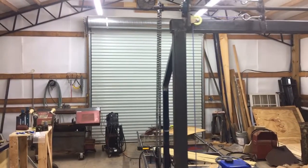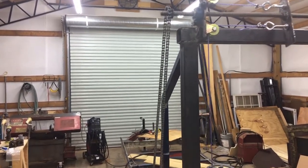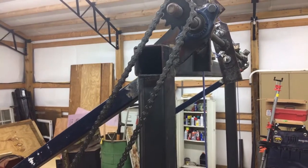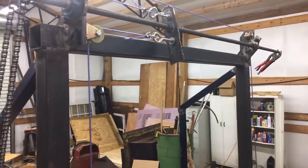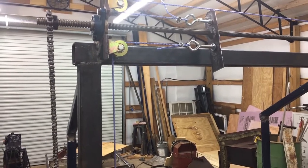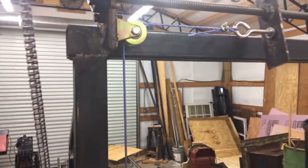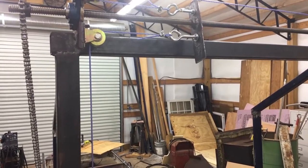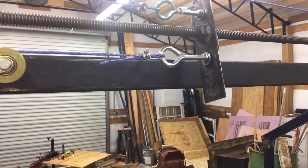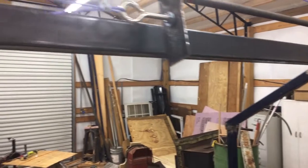So far it's working great. I've still got to take all these pieces off and put some keyways on the shafts so that I can lock these sprockets in place. Right now they're just sort of tightened on there, so they give a little bit, but at this point it seems to be working pretty well. I've still got a bunch of locking down to do — I've got to put some more nuts on there to tighten those cables down and make sure they stay secure. I'm also going to do a little adjustment to that piece right there that the threaded nut is welded on to.